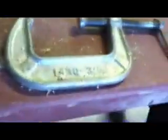But what I'm going to do is get my wood glue. I'm going to pour some into those cracks, get 2 pieces of wood to put on top and bottom just to keep it shut, and then put on some standard clamps on the top and bottom, and then seal that shut and just leave it to sit before I go and sand it some more. That's not a problem. I'm just going to put the glue in there and fix those cracks right up.